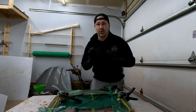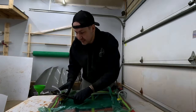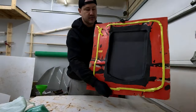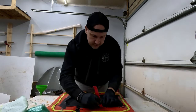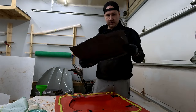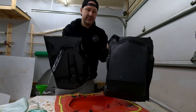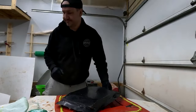It's a new beautiful day — it's 4:30 in the morning, my family's sleeping. I just couldn't contain myself, I'm so excited about how well this bag turned out. Look at that — isn't that beautiful? Let's get this apart. Look at the PVA off there so you can actually see — it's sort of shiny. You can see the difference with PVA versus without PVA. We'll get it cleaned off. We'll be back — going to let this cure. While it's curing, I think we're going to try and make a fiberglass one, because a lot of people want to wrap their stuff or paint it whatever color their car is. We'll use the same molds and do a fiberglass one, finish it in primer, and people don't have to pay the big money for carbon fiber.